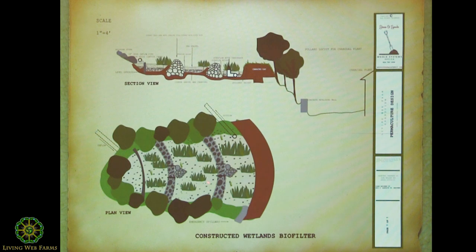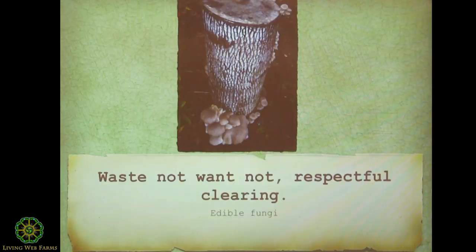Here's the plan. We had a small gully on the land and we converted it into a filter - a little wetlands biofilter. I lined the bottom with clay, it's got charcoal and gravel in it. The water comes down the hill, hits this, has to fill up, goes on the surface, then goes underneath and has to fill up these little subterranean ponds, then flows over, fills up the next one, and then it goes out. It's a neat little thing you can do.